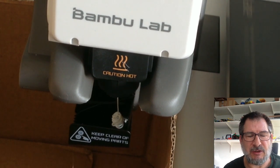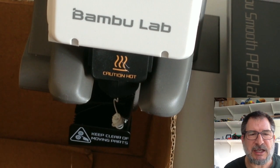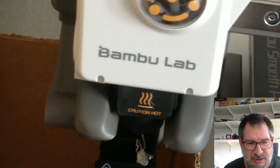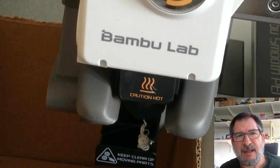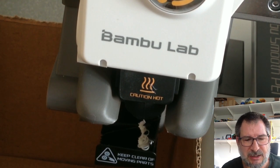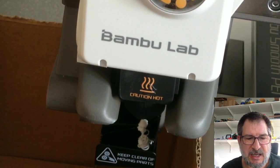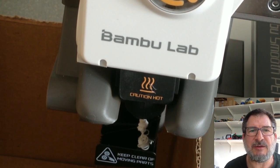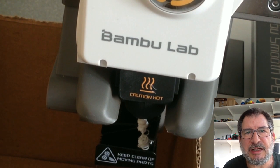You can see it slowly, slowly purging. That's the initial purge — it hasn't actually gotten to the actual purge part yet. This is going from white to black, and it's going to be hard to see the black but I end up using a flashlight. It would normally just jam it out of the way — the force of it coming out pushes it away — but as you can see it's already collecting on the tip, and each time I end up with a big melted blob on the end of the nozzle.